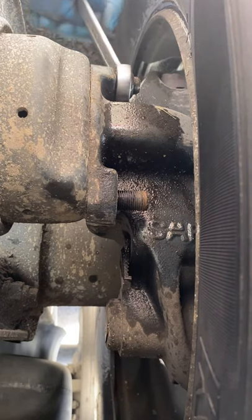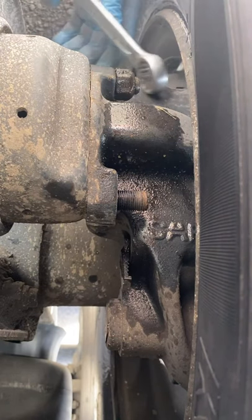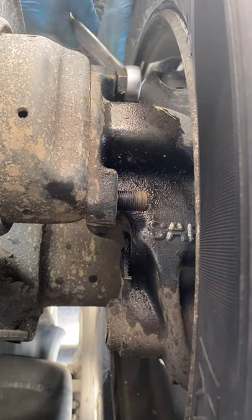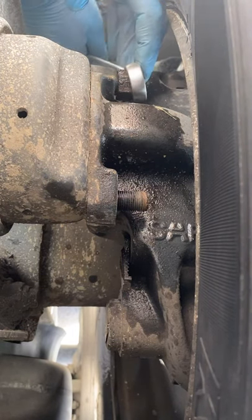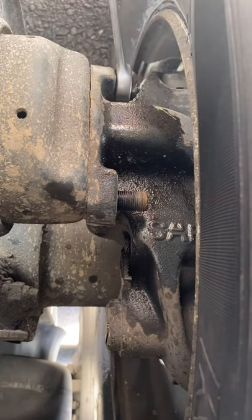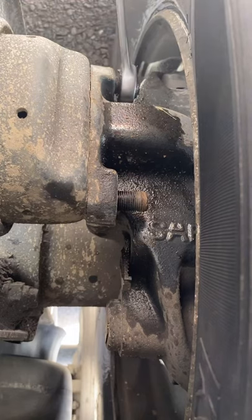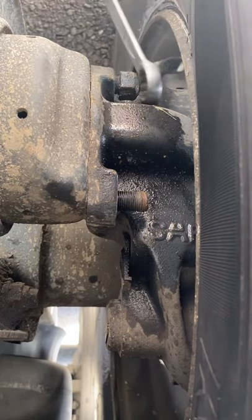Incidentally, this trailer is going for MOT Monday morning, and it's now Saturday morning, and it's had a brake test, which it passed, no problem at all, unloaded, so we had a full set of locks, everything needs to lock when it's unloaded. If you can keep it above 500 kilo per wheel, everything did it no problem.